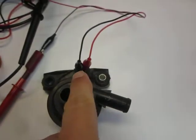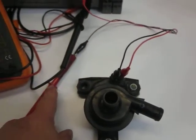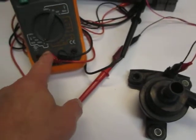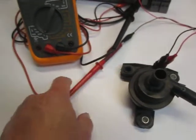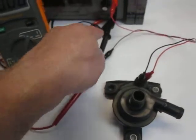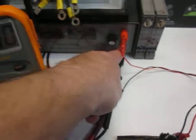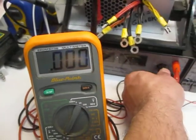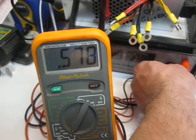What I've done is wired up power and ground through the meter here — my meter is a direct reader. Ground comes in here, out on the black, and back to ground on the power supply right here. I'll turn this on and you'll see we're initially pulling about half an amp.